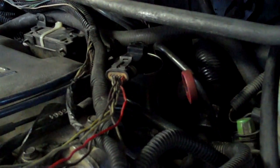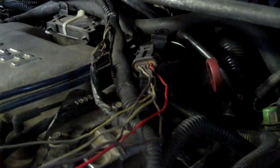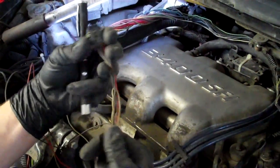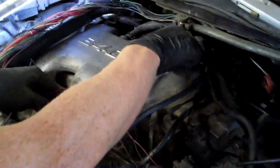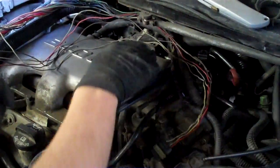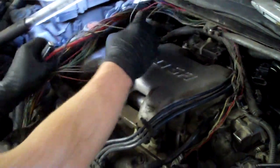I probably could have done a little better homework on that — my bad. You look at some of these wires that are bent together — they're parallel but not stuck. Actually, all five wires coming off of the EGR valve were stuck together; you had to peel them apart like string cheese or Twizzlers. I had to take off all the tape and follow the wire back, and as I'm peeling these wires apart, I come across a splice.